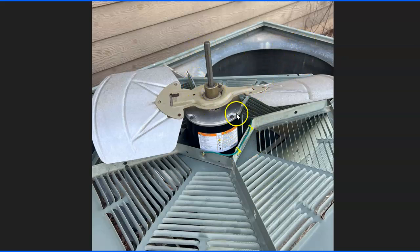They said this is a common problem when you replace the motor — some motors are taller. Since my other one was a one-fifth horse, it was shorter. This is a one-quarter horse; it's taller. Because it's taller, it moves the fan down lower. So this is as low as I could get the fan. It still operates, it doesn't hit anything. And this shroud, instead of being here in the middle, it's about here. So it's not as good as it should be, but it's as good as I can get it with this motor.